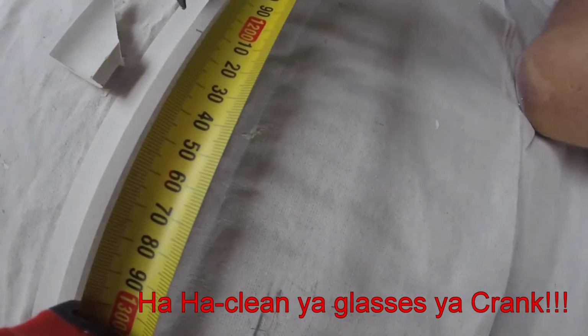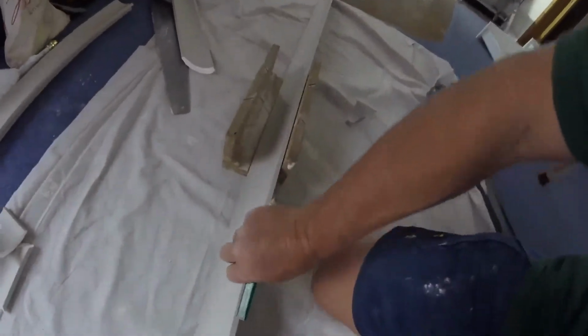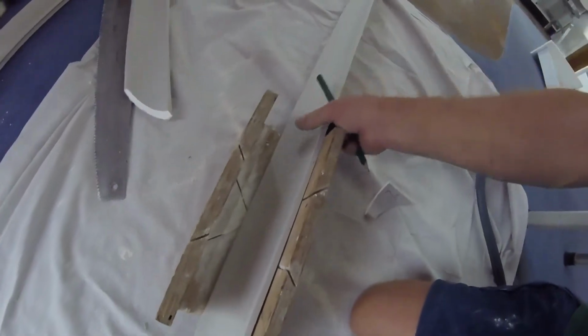And we want an external. So your ceiling angle is actually longer than your wall angle. So you want to sort of cut it that way. See, there's your ceiling. So I just do that because when you're mucking around folding tape, moving corners, you sometimes can stuff up. So you put it back in your box.